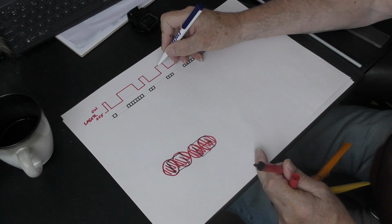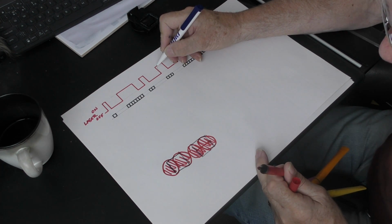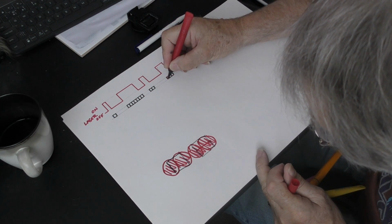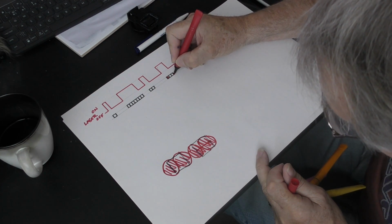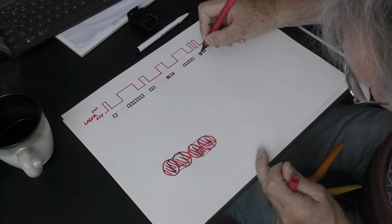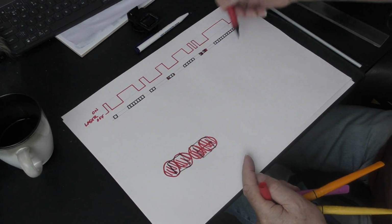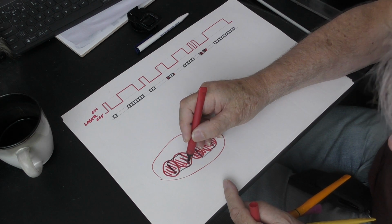And during that turn on time, which for instance could be like that, there is no power. Okay, so only when the beam has become pink and we've got current flowing through the tube do we get power output. So although we've told this beam to switch on at this point, we don't actually get power until maybe the middle of the pixel. And then it instantly switches off here, and we might get half a beam hanging out the outside. We're going to get a delay here, so we switch on half a pixel late, and we switch off. Yeah, we've still got two perfectly good pixels there. They just happen to be out by half a pixel. So we're not distorting our pixel string like we are here when we're using an RF machine which switches on instantly and switches off instantly.